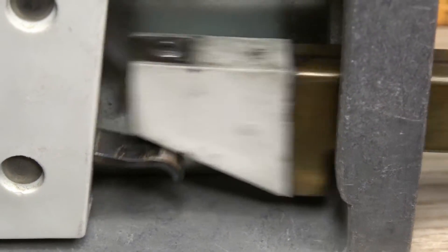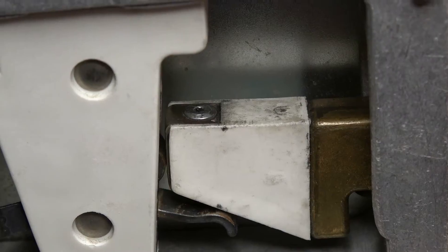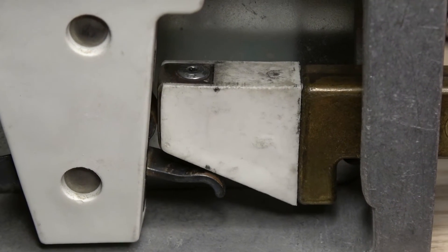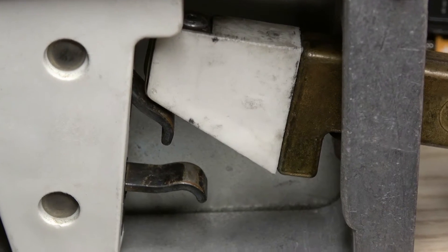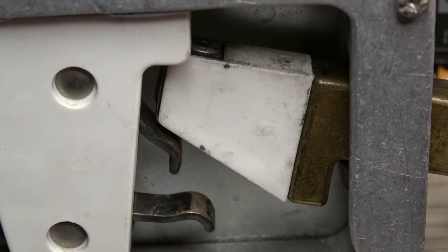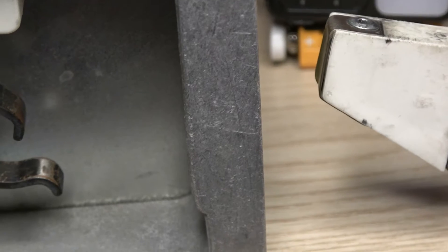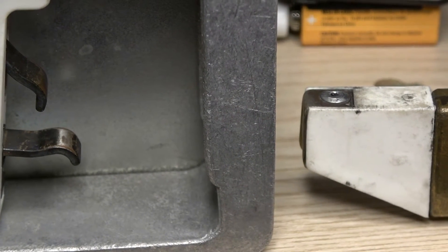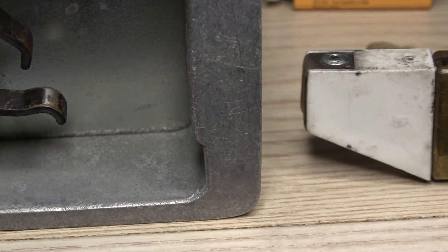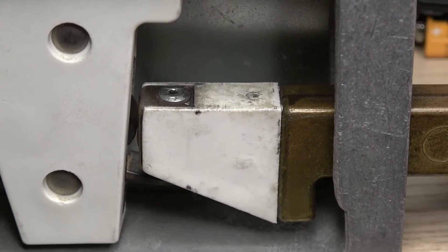The way this opens is basically this latch hammer shoots up like this, and you see the switch is now moved, which means that the elevator car cannot move because you can now slide the door open. And now that the latch flips down, if you let go, the door will do this — it'll close right back up, just like what you see on an installation.